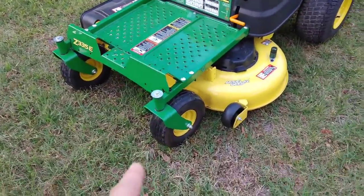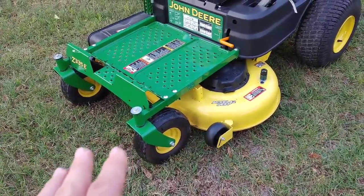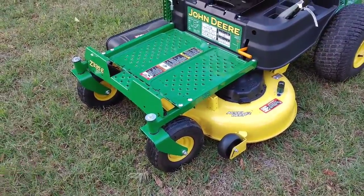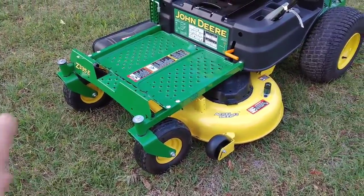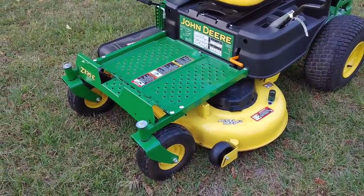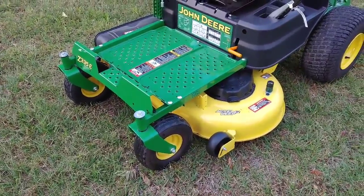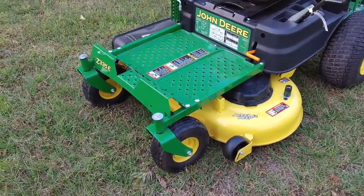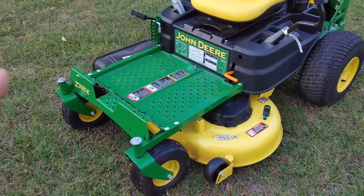As far as the front tires, I don't know what the issue is — they always seem to come in with low air. Maybe you can put some type of sealant inside the tire. I don't think a tube is the way to go; they are tubeless tires. But you need to check that air pressure. In that other video I made I said 44 PSI — well, it's actually 46 is the max, but it seems to do better if you put it up around 40 to 44 PSI. But you want to make sure if you ever go to level the deck, all your tires are inflated properly.